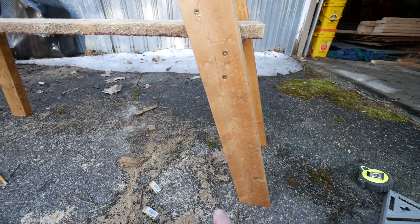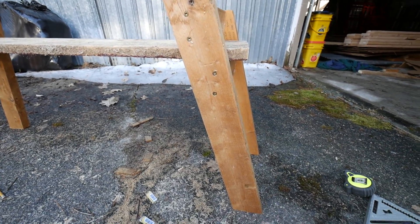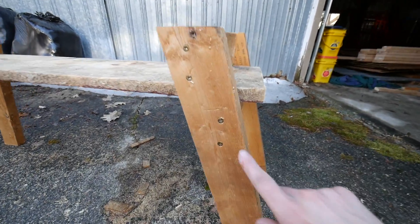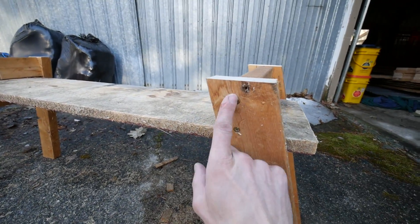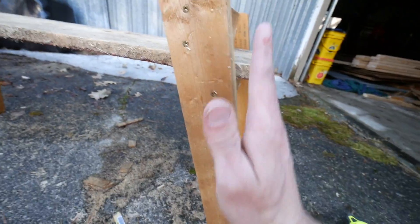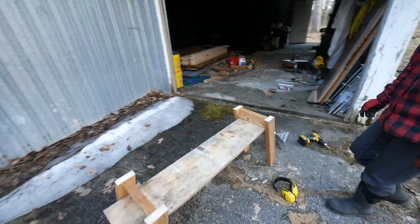So this is how I did it. I basically just chose 15 degrees for my angles because it sounded good — there was no big reason for that, it was just a decent angle, not too much, not too little. I offset the two by fours so that when the pressure is pushing down it's pushing up on this one and down on that one, because when you're on it it wants to bend and it can't bend. But when you turn it straight it loses the pressure and it's easy to pull out. Go ahead and try it out.